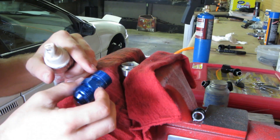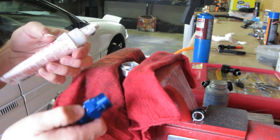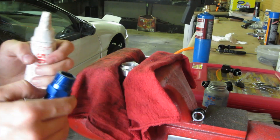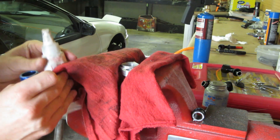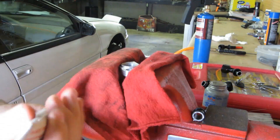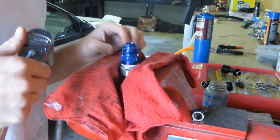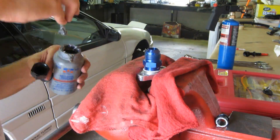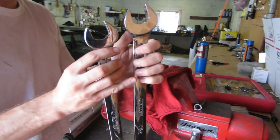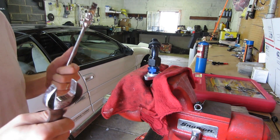These are MPT threads and they do seal themselves as they're tapered. But you always want to put something on aluminum threads — whether a sealing agent or something like an anti-seize that lets the aluminum go together and tighten without galling. The moment you tighten aluminum on aluminum threads, it's going to gall and seize together and you'll never get it apart with threads still intact. When you're using wrenches this big, it doesn't take much to strip out aluminum, so once you feel it getting snug, only go a little bit further.